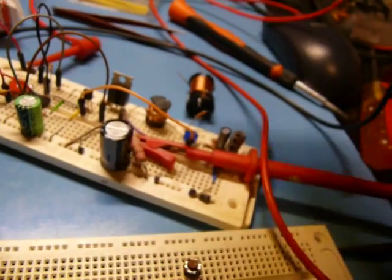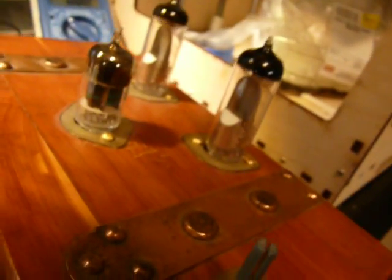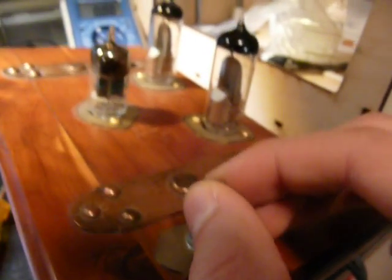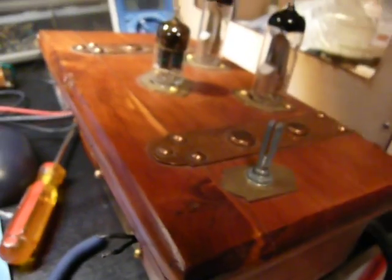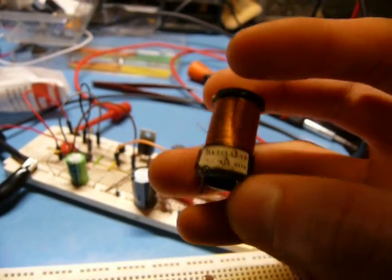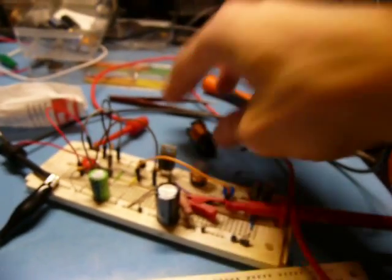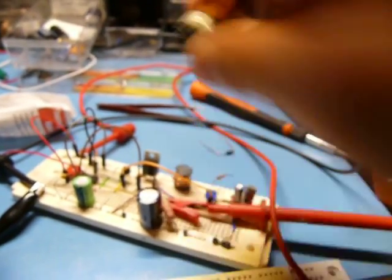I think what I'm going to do is build this up just so I have a working amp. At work I'm not too happy right now because my laptop has a terrible DAC — well it has an okay DAC, but the Apple power supply is terrible, so it can't drive even my normal headphones at low volume. Anyways, I want to have this back. I'm going to build a very high power boost power supply, then maybe I'll build a flyback, but I really want to pump out ridiculous voltages. Let's see if it'll work, and then I'll build this up and call it a day.